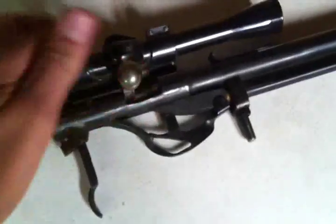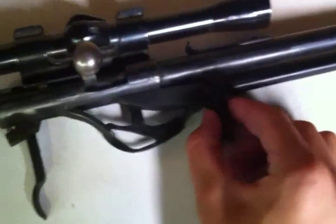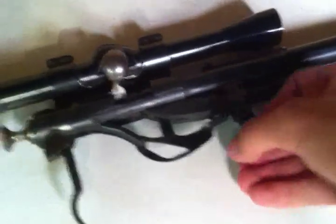What you want to do is flick the bolt all the way up so it's lined up with the groove, and break this nut loose — just barely break it loose, just a little bit. Then slide it right up again with your fingers, and then you can take this bolt and back it out as far as you want.